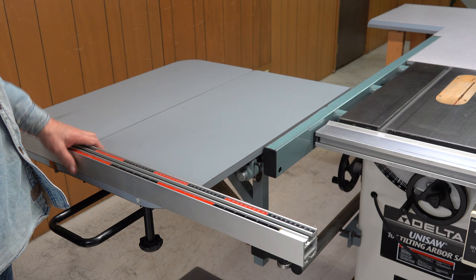And the reason why it works, there are 8 of these in total, you're seeing 2. A split piece of nylon. Tighten up the screw, the nylon gets bigger, it now fits tight in the slot. And because they did that 8 times throughout the whole unit, there's where you get your accuracy from. Again, both work very well.